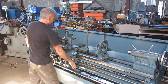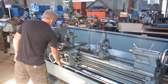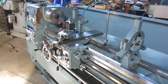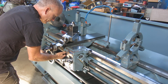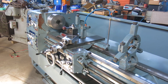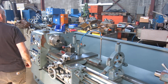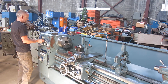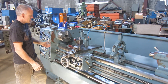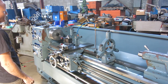Rotate it in so you feel it — this is 950 RPM. I don't like to run chucks too high; we'll do 1350 but I really don't want to run it at 2,000. You don't know how balanced they are. There's 1350 RPM.